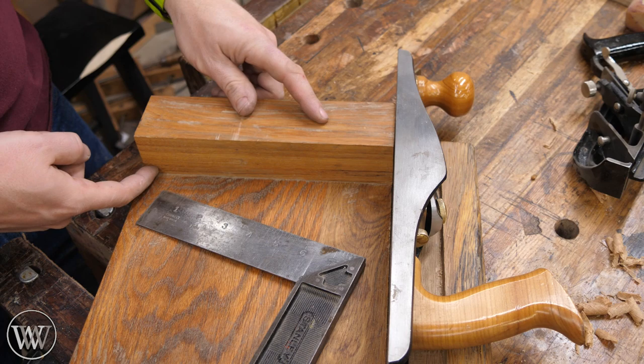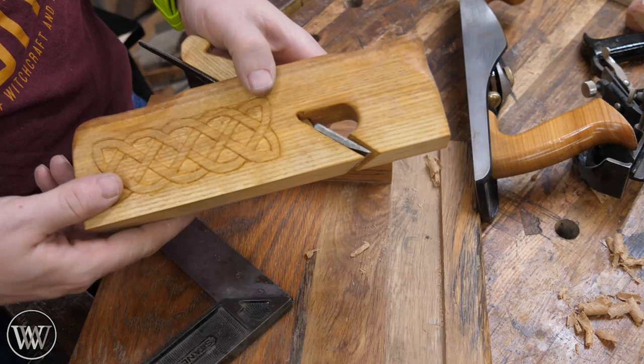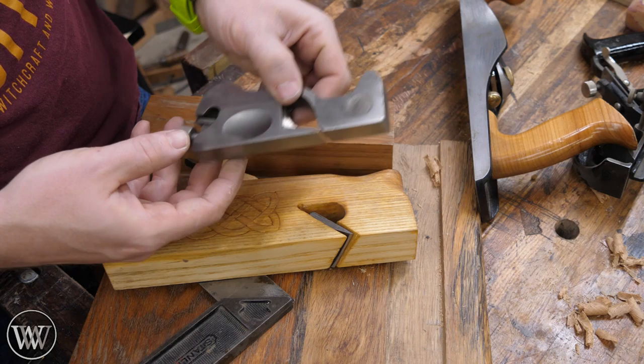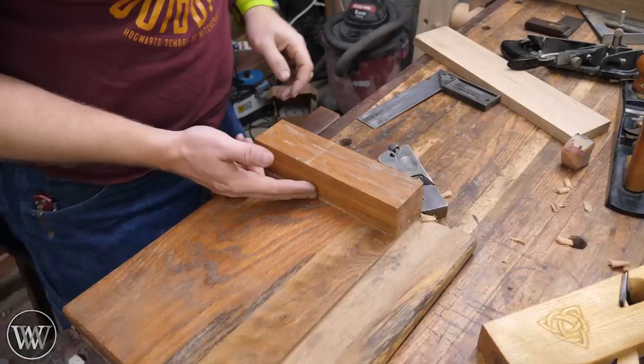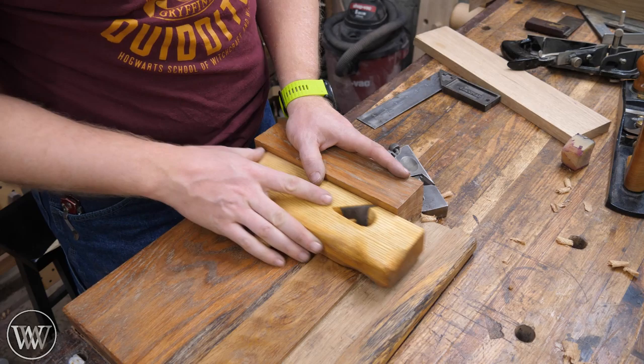All shoulders have this edge here, so you can't plane right tight into the corner. That's where a shoulder plane comes in, because a shoulder plane can come all the way to the outside. Shoulder planes come in many different types — you can get them as block planes, the more common shoulder plane type, or even a rabbet plane. As long as the iron comes flush up to the outside, it'll be able to get down into that corner. So I could come in with this and clean it out, or I could take the fence and depth stop off of my rabbet plane — or for those in England, a rebate plane. In this case, I'm just going to use a small shoulder plane.